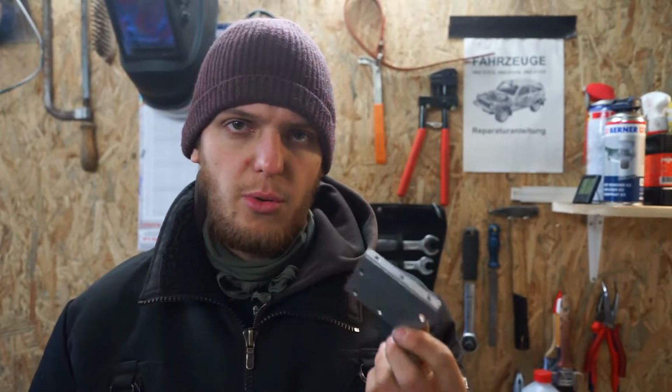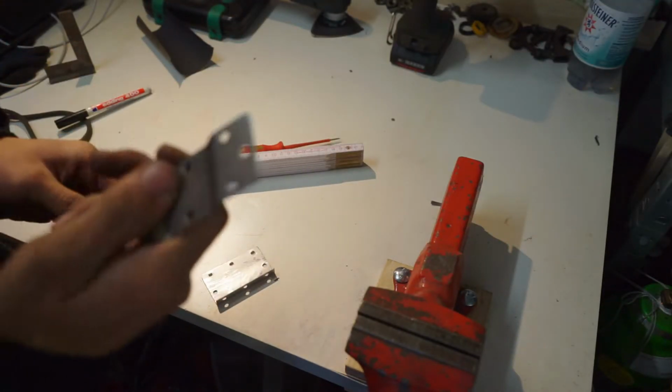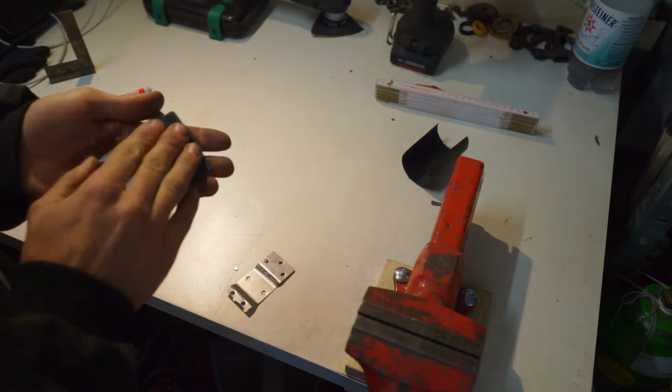So both pieces are ready. This piece is for the right aft part on the other underbody, and this is for one of the spars. There's this little hole, and I would like to patch it. Now I can spray it with zinc spray and tomorrow come back and weld it on. Now I forgot to make some holes into this part, so I did this. Now I will sand these two parts and then spray them.